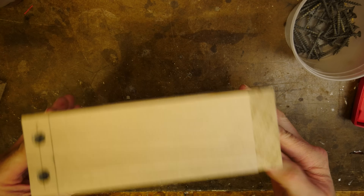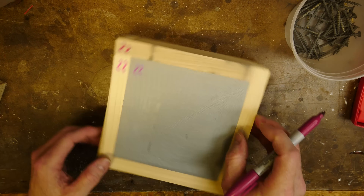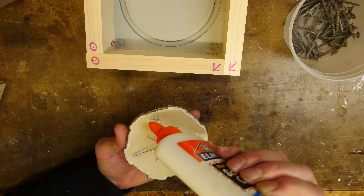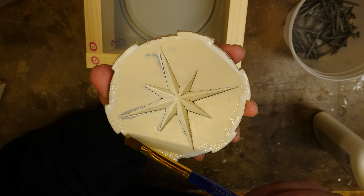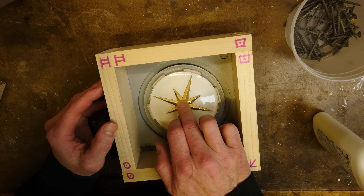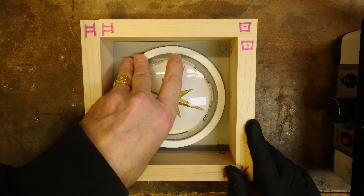Next, we'll flip the box over, check it out, and make sure it's all nice and flat. We're going to mark all the surfaces so that when we take the mold box apart, we can put it back together in the same way — from the top and the bottom, since we'll be using the mold boxes the other way around for the second half of the mold. I'm going to apply a little bit of PVA glue — it's water-soluble and non-destructive — to create a nice seal onto the 3D-printed splitter board. I'll center that right on the little imprint ring in the middle and press down for a good seal. Then I'll put in the TPU key seal, which is what's going to hold the two mold halves together nice and secure.